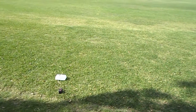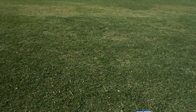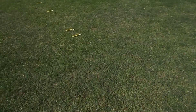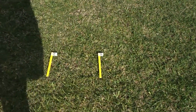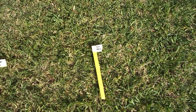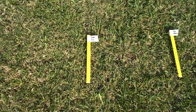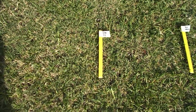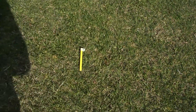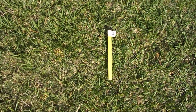So we've done our measurements. This is the base station and you can see there are a few yellow pegs in the ground. We'll walk towards each one and see where they ended up being placed. The first peg is our thin helical — what I thought was going to be a good ground station antenna — but it was actually the worst performer. Really close to it is the J-POL PCB antenna, and that's interesting because they both are the worst performers.